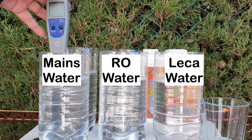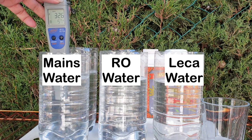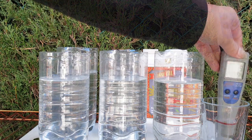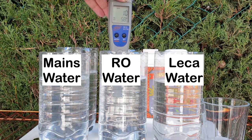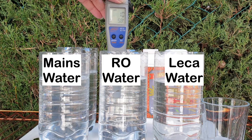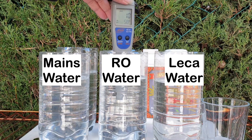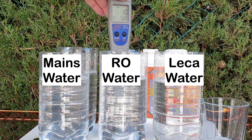Let's dip it into my tap water and see how it reacts. This is my plain tap water straight out of the faucet — and this is what I get: 325 parts per million. My RO water reads at 10 — that's awesome. 10 parts per million coming from tap water that was at 327. This is brilliant for me; I need these low levels. Other TDS meters will go down to 2, 1, and even back to zero, depending on what the water quality going into a reverse osmosis system is and how much it can actually filter out.